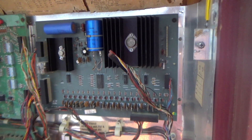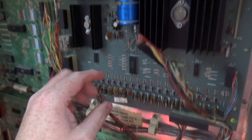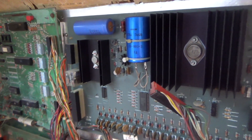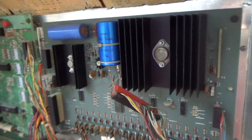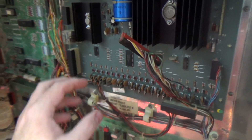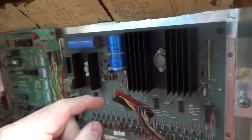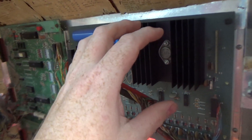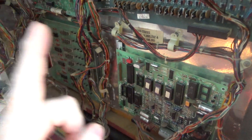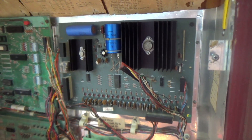The next thing to work on is this solenoid driver board. It has three areas: this area down here controls all of the solenoids; this area controls the high voltage for the displays; and this area takes the 12 volts and turns it into 5 volts. The high voltage for the displays goes over to the displays and makes them work. The solenoid driver, via the MPU, controls the kickers and everything on the playfield. And then the 5-volt section takes the 12 volts from the power supply, regulates it to 5 volts, and then controls the MPU, the lamp board, the sound board, the auxiliary lamp board, and even sends 5 volts over to the displays. So that 5-volt section is the most important part of the whole machine electronically.